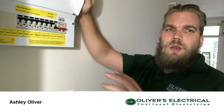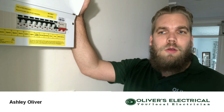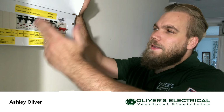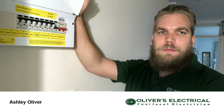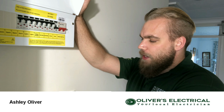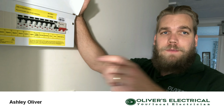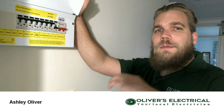In that case, what you need to do, and I know I'm using the hob for ease, but you were to do this on your sockets for sake of instance, and then you tested it and it won't go back up, or you come home from work or something like that and it's down and it won't go back up, the first thing you need to do is go around and unplug absolutely everything. I know there's a light switch, but sometimes you get these where there's a switch next to it and then a fuse. Switch those off, switch everything off, and pull the plug physically out of the wall, put it on the floor, just because then if there's a problem with an item, it's not going to be that problem.